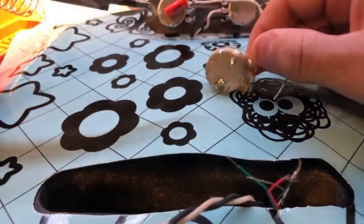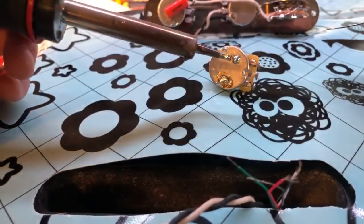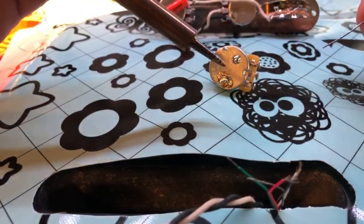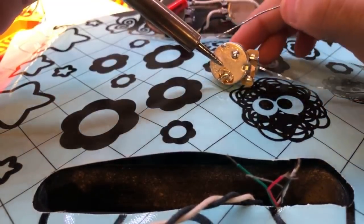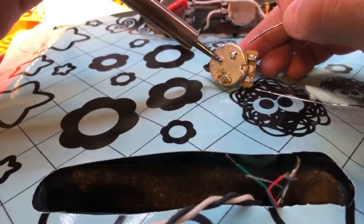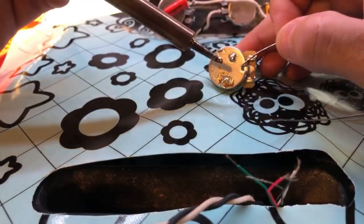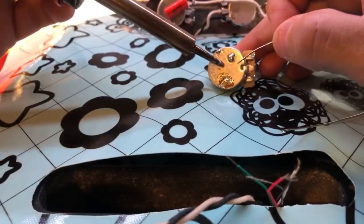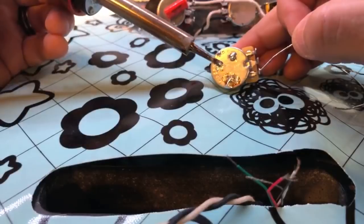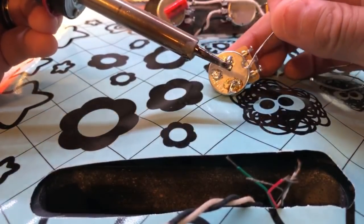Our iron is hot. Put it on a point that has no solder — and it's that easy. A lot of people will say 'you should sand the back of a pot' and all that, but if it's clean, the solder is good, and you have good heat transfer, then you have no issue. Now, if you use just the corner of the iron and try to solder with it, it doesn't transfer as fast — you're making a hot spot because there's no heat transfer between components. But if you turn it on its side and use the width of it, look at that — good solder pool.